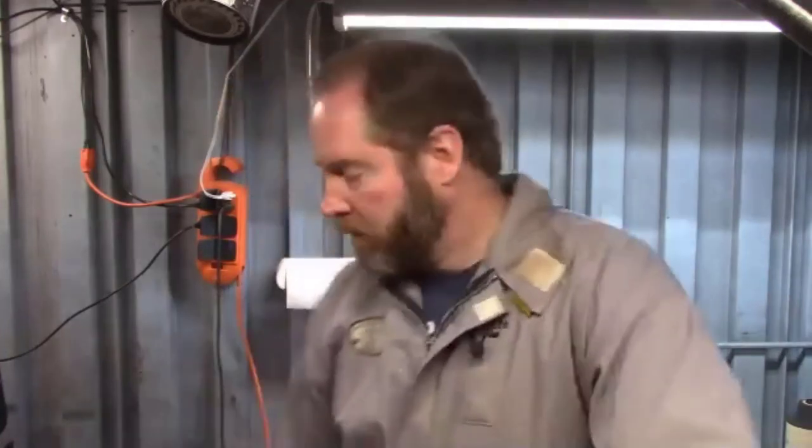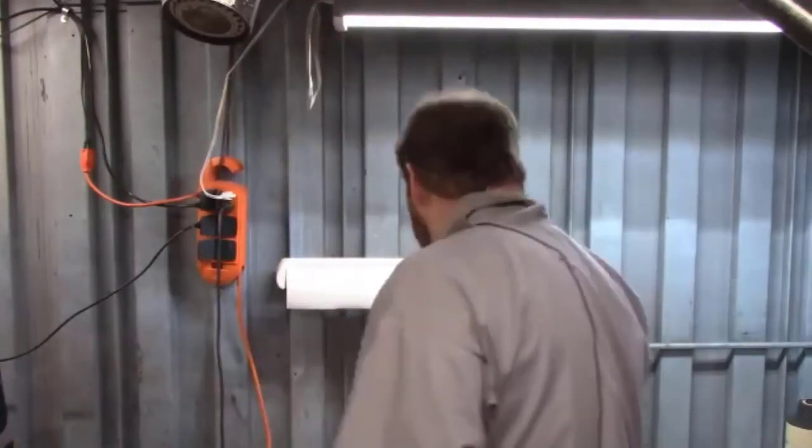That one was a little more involved because you had to have a special adapter for your specific chuck. There are some people that make almost like a turntable with an indexing pin that you can use to set up, and those are typically done when you're into like 150, 200 pieces open segmented. Jerry Bennett also sells something called a Seg Easy Plate. Basically it's routed out the same way, and it has little ridges in it so that you put the pieces in there and it automatically spaces them out.